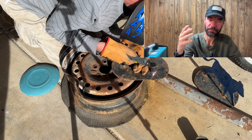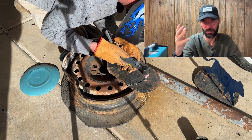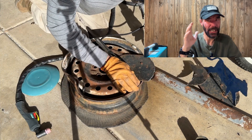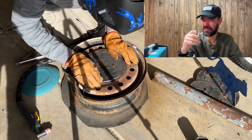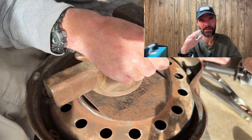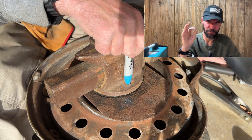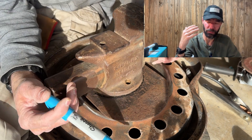On 110 volts it'll run up to 35 amps, and up to 50 on 220. I do need to express a caveat — I've only got a 20-amp circuit set up. 30 amps was all I could get without tripping my breaker, and even then I could cut for a second then had to let it rest. So this review is based on a 20-amp breaker. It was just right at the ragged edge of being able to cut through three-eighths plate on 30 amps.